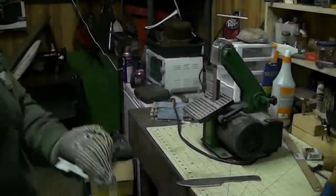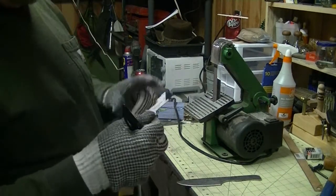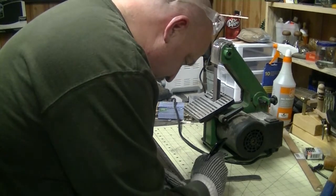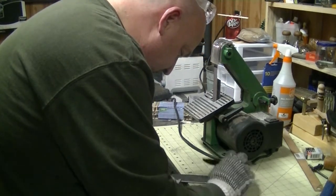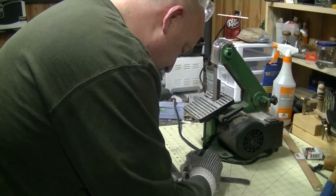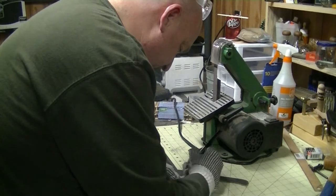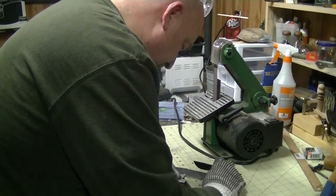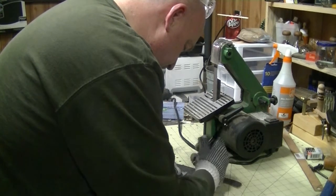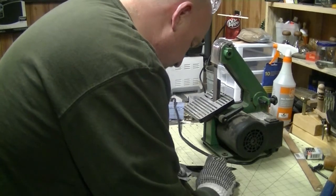What I'm doing now is taking this little measuring gauge — it's marked at a quarter of an inch — and I'm just placing it right there on the edge and then I'm just hitting a line. What that's going to do is give me a grind mark where I don't want to go past, and whenever I'm coming up it'll help me avoid having that warp in my blade with a thinner grind here and a thicker grind there.